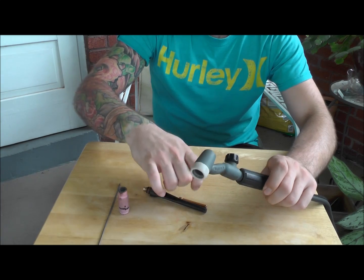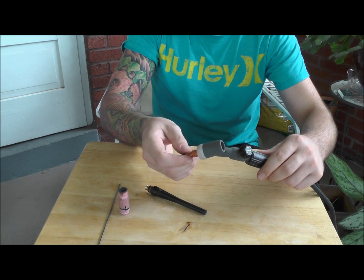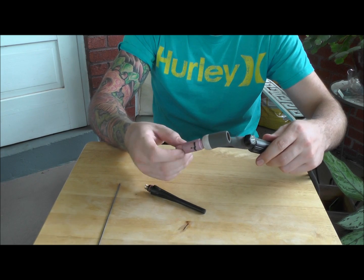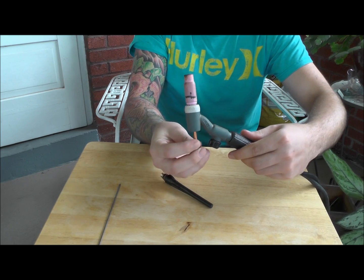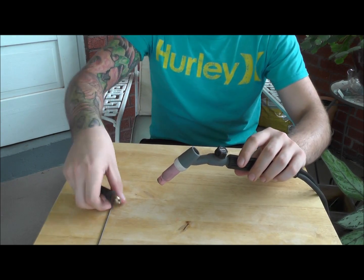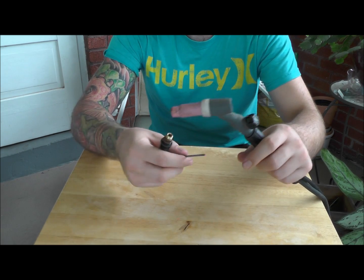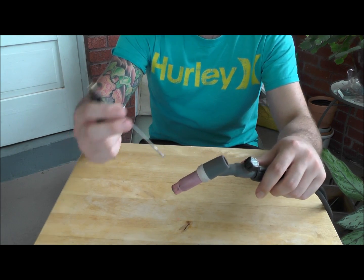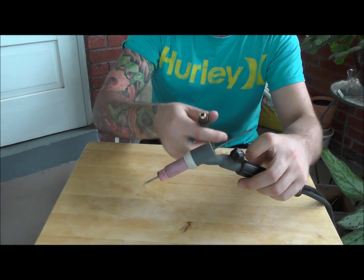When I put it back together, I like to put the collet inside the collet body and throw that in first. Tighten that up, then put the cup back on. Make sure you have it facing downwards, because if you flip it over your collet will slide right out — so always keep it facing down. Depending on what condition your tungsten is in, you might not be able to slide it in through the front. For this, I'm going to slide it in through the back, which is the proper way since the tip is sharp and slides in well.